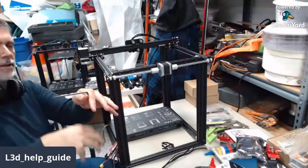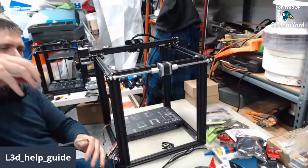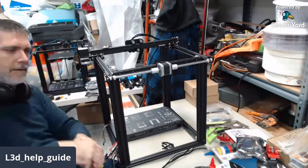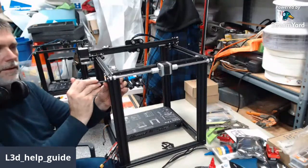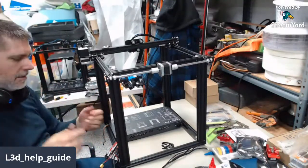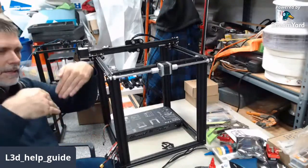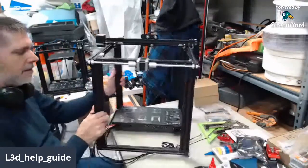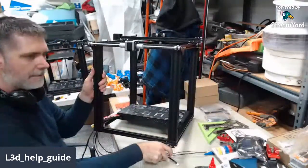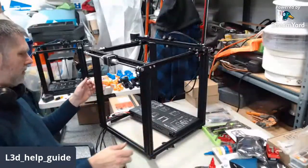because of retraction, imagine that you're creating a hydraulic chamber, driving the filament in and pulling it back, driving in and pulling it out. It creates hydraulic pressure, and it's not a ton, but enough to push against that, and eventually it will drive the plastic up and dig those teeth in more until there's an actual void in between the PTFE and the fitting, where it needs to not be.